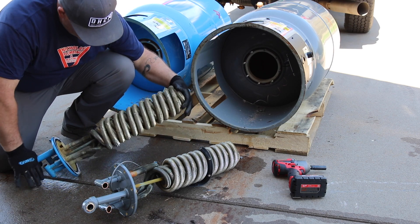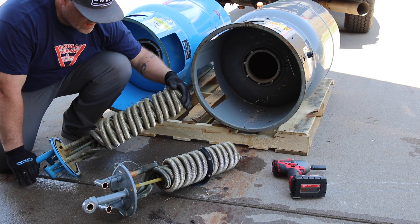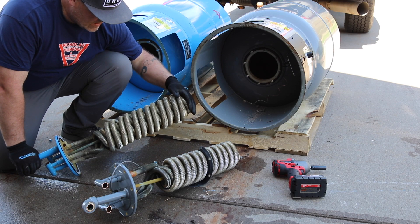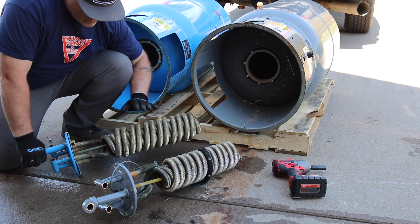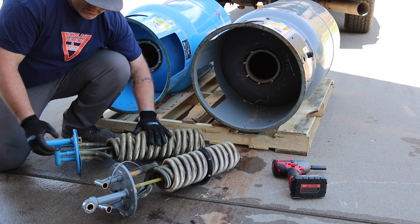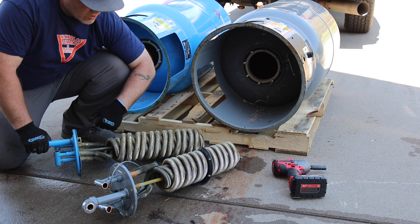Now, these were in use for about 14 years. They're very, very clean. These can corrode with calcium, magnesium, lime deposits, stuff like that. Now, these were clean because the domestic water going into the tank was very well conditioned, and these had never been serviced once, and they also did not leak. So there's technically nothing wrong with these, except of course I demoed out the copper, and now they're no longer usable. I'm going to cut these off right here, and then these will be brought in for scrap.